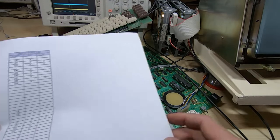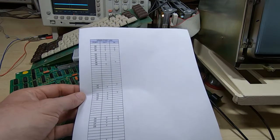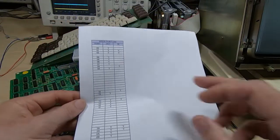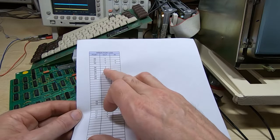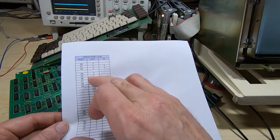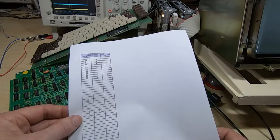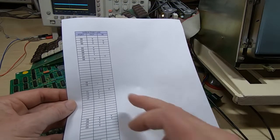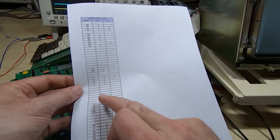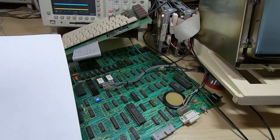So what I need to do is figure out where all this goes and what in particular is not working. And now I have this, there aren't that many. What I have are the addresses for each individual in-out device. Also, you can generally tell by whether they're out and in, or just out or just in, what the device is likely to be. Certain devices you wouldn't read and write, other devices you need to be able to read and write. And of course I can now turn the port number into a bit pattern and see which address bits that match this go to different parts of the system. So for example a multiplexer or something like that.